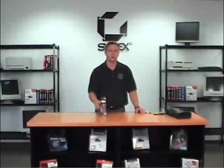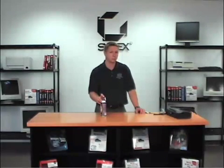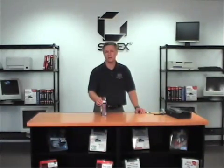As part of preventive maintenance, use compressed air to clean equipment out. You can also avoid the compressed air if you want to use an air compressor. If you use an air compressor, make sure that the air is 40 pounds per square inch or less. Also make sure that you're taking out the moisture. You don't want the moisture getting inside the machine. These cans work very well, however they will cool down over time, and as they cool down they're more prone to put out moisture. When the can starts getting cold to the touch, stop using it. Never use it in anything but the upright position as well.